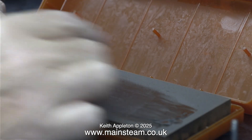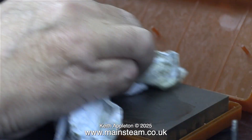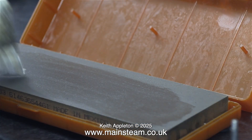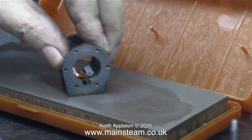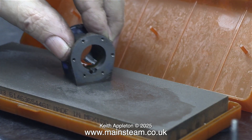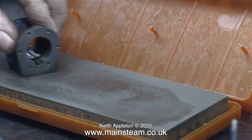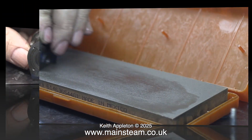The video is of course running at high speed. I've been told from time to time by YouTube experts that when you're using a wet stone you should rub the part in a figure-of-eight motion. But I usually rub the port face on the wet stone transversely, in the opposite direction to the way the valve moves — the valve will do the rest.